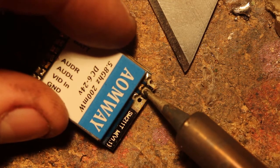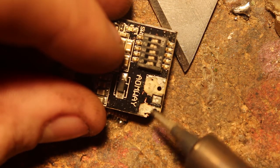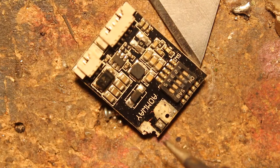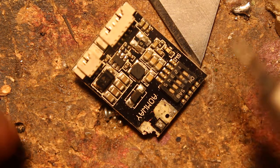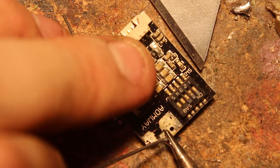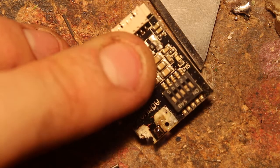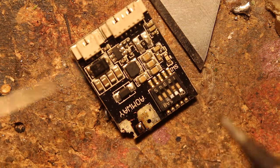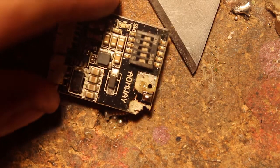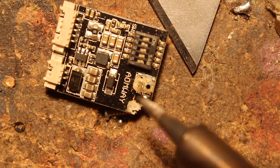Our outside sheath we can connect to any of the four around the outside. So we only need to join this middle one and then any of these four outside ones — we can pick the best of the outside ones. Probably this side of the middle one is best. We'll put some tin on it — put the soldering iron on there, hold it for a second, add the solder, and once it's flowed, take it off. You don't want to hold it on there too long, otherwise you'll start to damage things on the board with excess heat. You can see there's a nice shiny blob — if the blob goes matte and not shiny, it's not a good joint and you should reflow it.